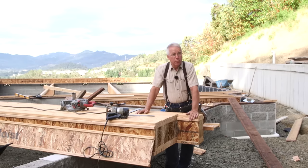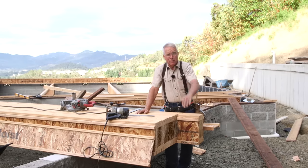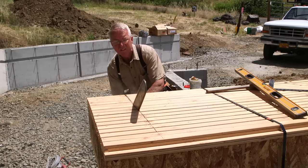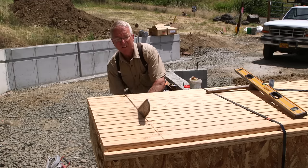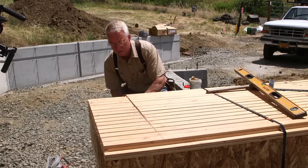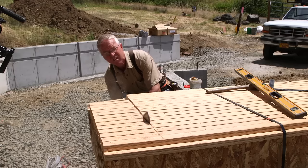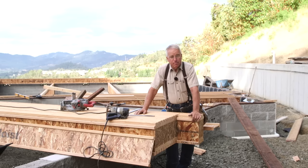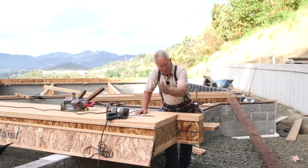to be square. I wouldn't do it with a short bar saw, so you guys in the Midwest that have got, you know, the 16 and 18-inch little bars on your saw for limbing the stuff in the front yard, don't try this. Just flop them over on their side and put a square line on there and use your skill saw. But if you've got a saw with a bar on there that'll reach a good long ways, maybe start long, make sure you can do it, and then make a bullseye cut.